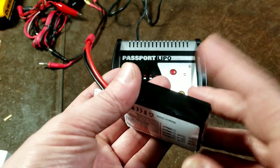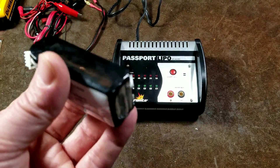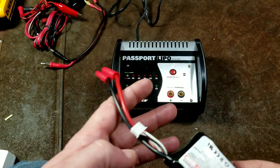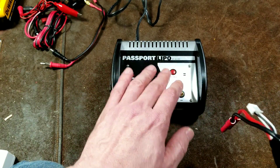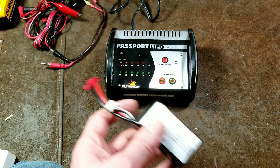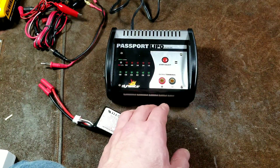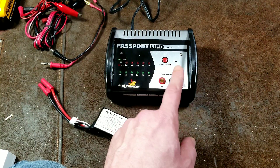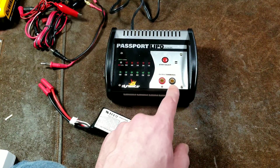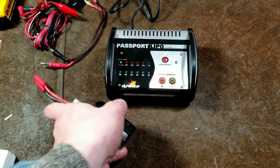These are small batteries, but they take various voltage lithium-ion packs. When they talk about 'S,' that's the number of cells. These chargers aren't designed just to charge one single battery by itself — on this particular unit, if you just hook one cell up to the main in and out, it may or may not charge it — but it generally needs balanced connections.